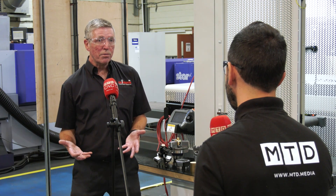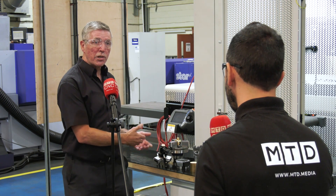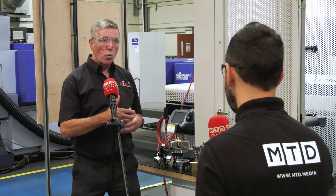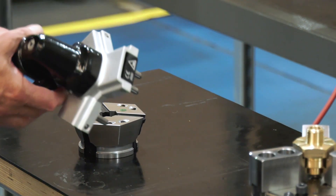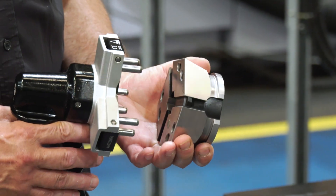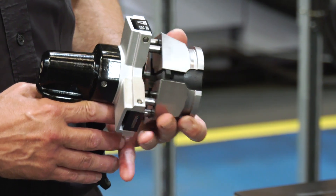To extend that, we've got a range of mandrels, face drivers, and all sorts of other morse taper adapters — the three jaw version, which comes as you can see here in a 145mm version and a 250mm version. So work holding is part specific, can be changed over very quickly, which means your batch sizes can be made productive down to a smaller range.